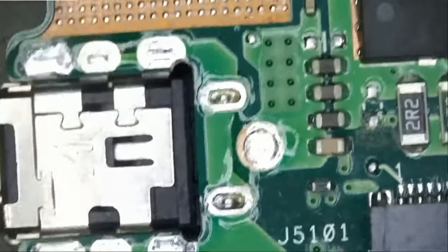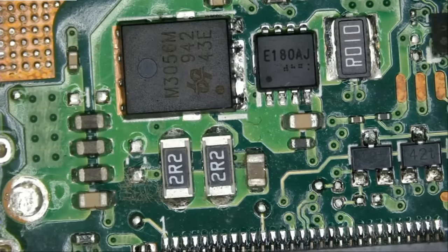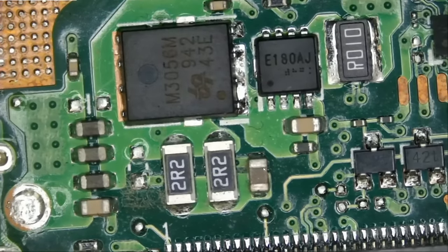Let's flip the board and look at the charging connector. We're going to start from here. Right next to the charging connector, we have some MOSFETs. Since I have the charging cable plugged in, let's plug power into the board and test at the drain of the MOSFET to see if voltage is reaching the board or if the charging cable is good. Big Boss already tries out everything before he puts the board on my bench — he already tried the charging cable and all the basics.